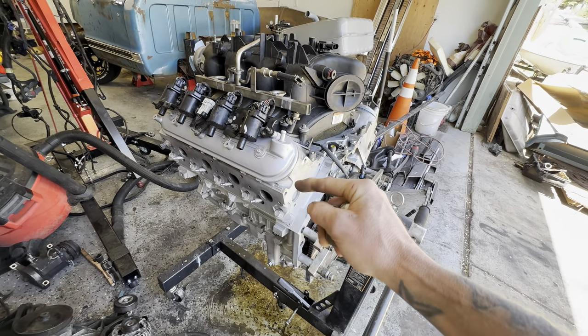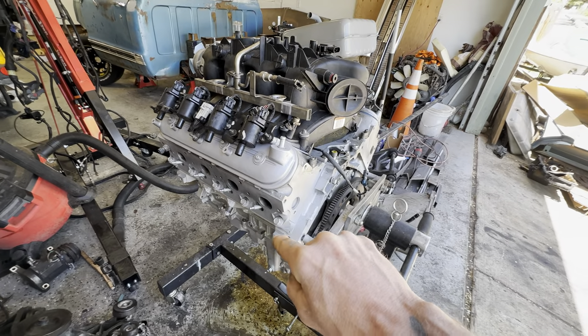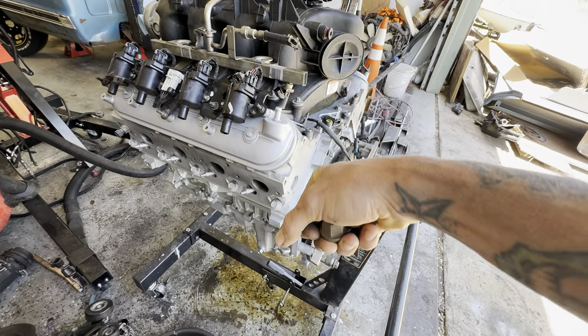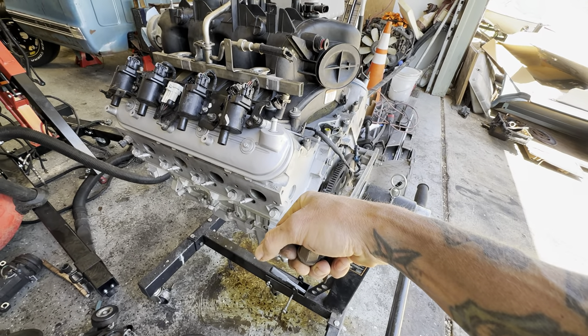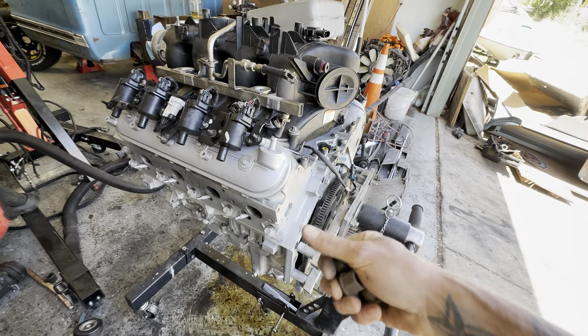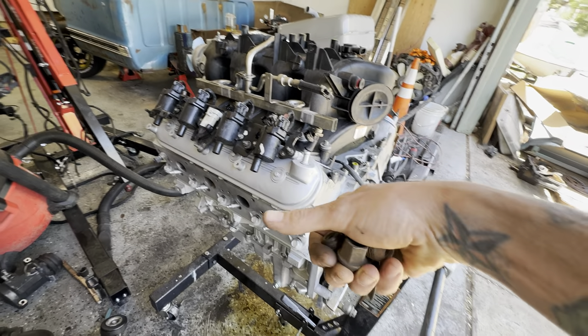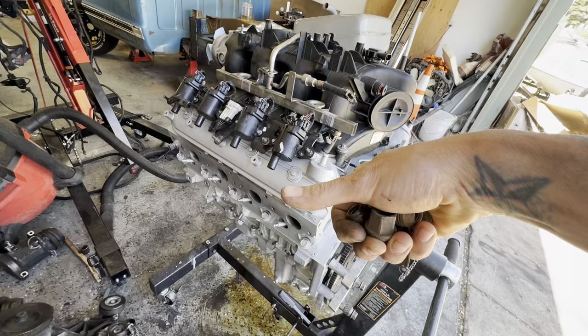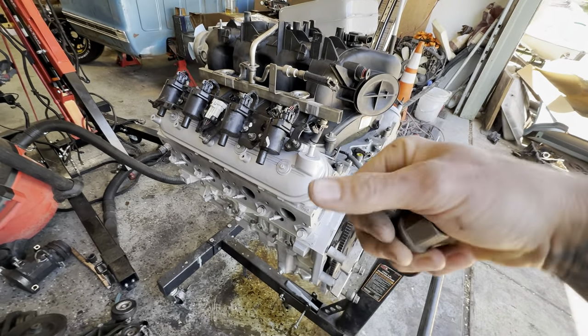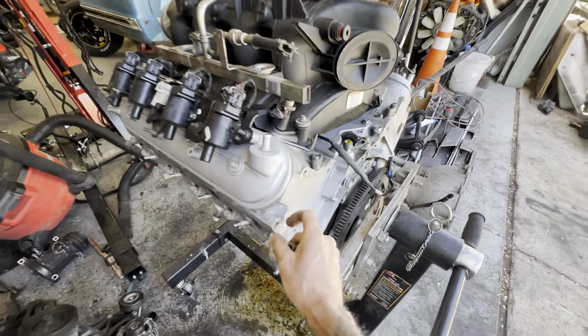You're talking about a steel bolt into an aluminum head — these are all aluminum. So you want to give it a little tightening first to break loose all the corrosion. If they were trying to back it out and broke it and gave up, you're relieving that bind — get rid of that first, then try to take it out.